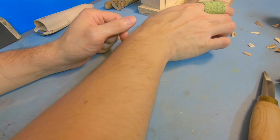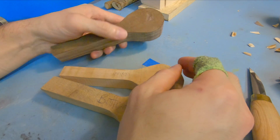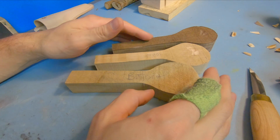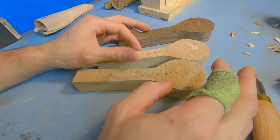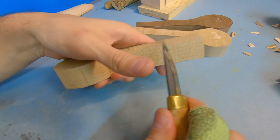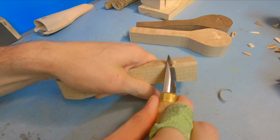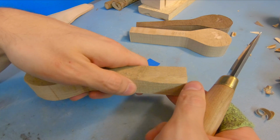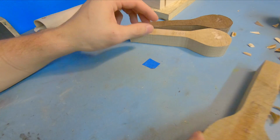Well, let's go into some other different types of wood that you'll most commonly see. I have here butternut, walnut, and cherry. All great different woods, but they are a bit different in how they cut and how hard they are. If you are just starting to do something like spoon carving, probably give butternut a try. It is a nice soft wood that you can easily take wood off with all day long, and it has a really cool finish to it. So that one I'd probably give more of a shot for starting off with.